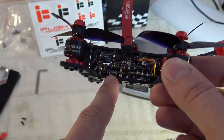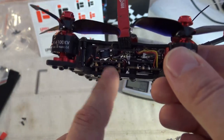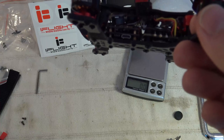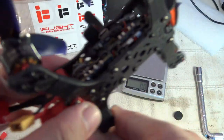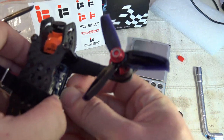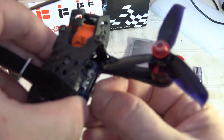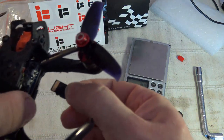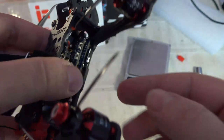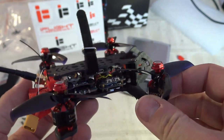The more front is the Runcam Split Mini, and as you may know, at least for the first version, we have two boards. The lower one has a micro USB in case you want, for example, to upgrade or to export some data. The lower also welcomes the already pre-installed micro SD card slot, so you will need to gently raise or bend down this metallic bar. It will release the micro SD card, and then you can access the micro SD. Prefer a class 10 minimum, or a U1, or even better, a U3. When you insert, you can hear a click and then raise this metallic bar up to avoid an accidental ejection during crash.